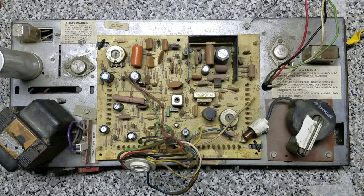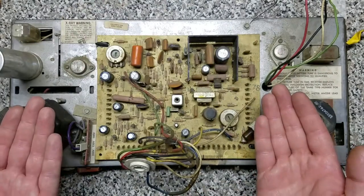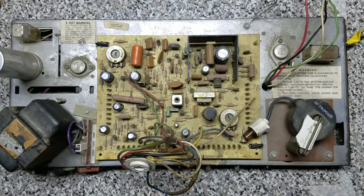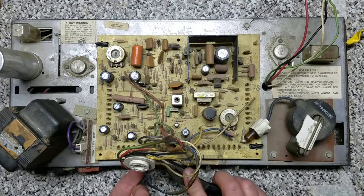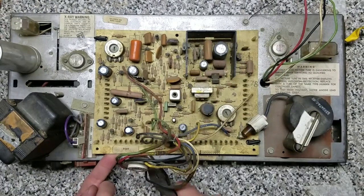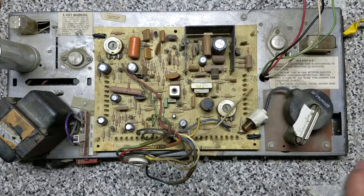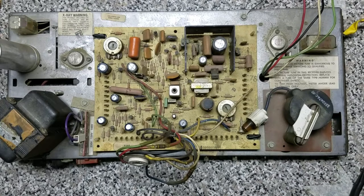What's nice about this chassis is I can turn these little clips here and this board will literally come up off the chassis and be released by these pins. It comes up real nice with just a little bit of pressure. We've got to clamp these plastic releases in though — we want to do it gently because we don't want to break any of the traces in the process. So I'm going to pull this board out.